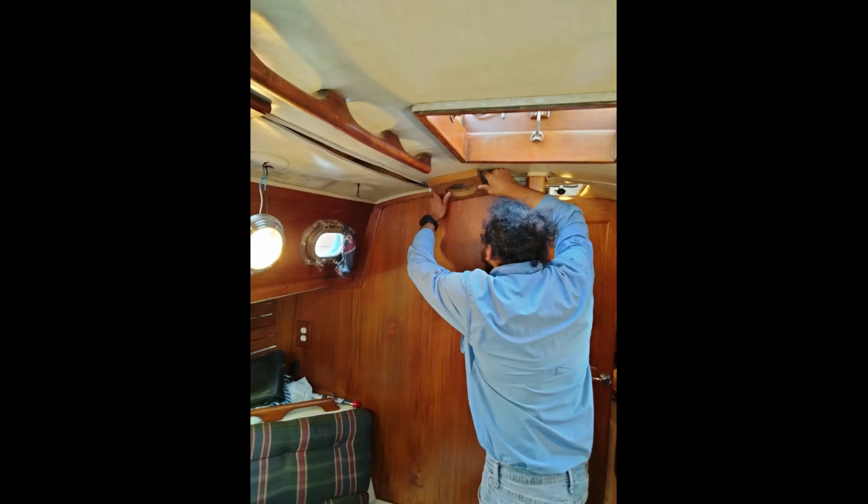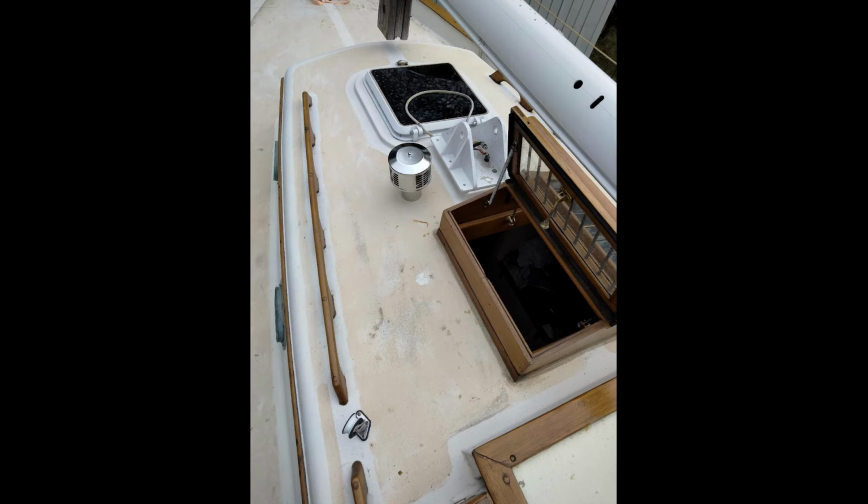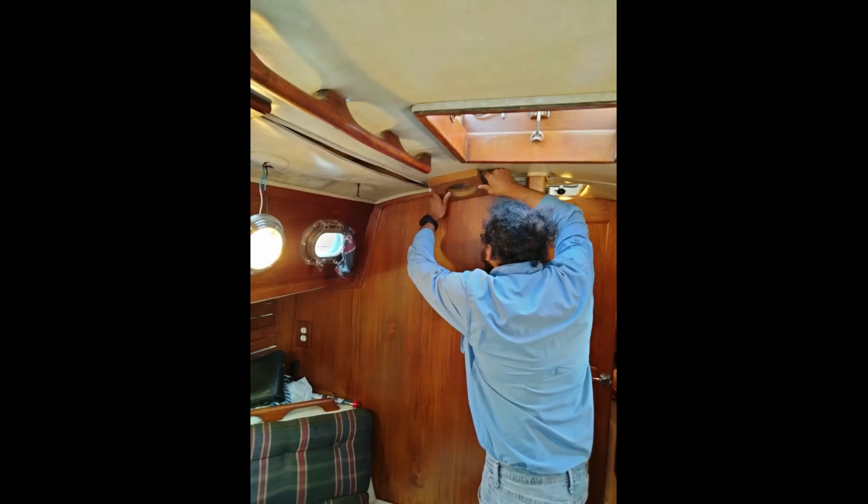So now we took the donut with the flat side, taped that to the cabin headliner, and found the center point in that donut of where the stovepipe would go up through the cabin to the deck up above. For reference, we used the distance to the mast step, compression post, and the butterfly hatch in the cabin to estimate where the Charlie Noble would pop up on deck. So we drilled a small hole at the center of that donut in the cabin, checked where it came out on deck. So the location looked good.